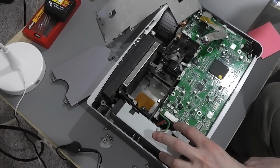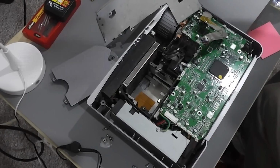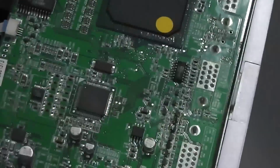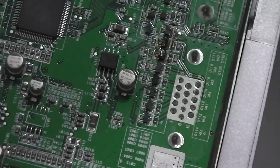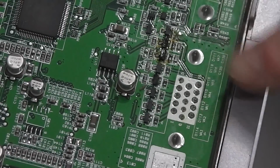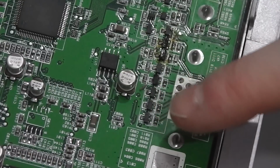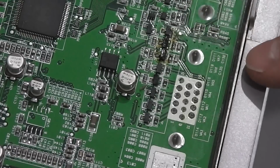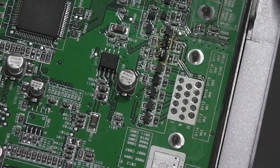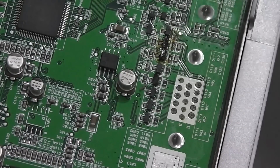and that should give me the data, so I know that will be at fault. There's also another dodgy bit on this unit here, which I'm going to try and zoom into. There's a row of transistors in here on the VGA inputs. This is the main VGA input to the unit, and it looks like some kind of transistor buffering going on here on the connections, and these last three appear to be damaged, but there's a lot of what might be residue from reworking, so it's possible someone's attempted to repair this.